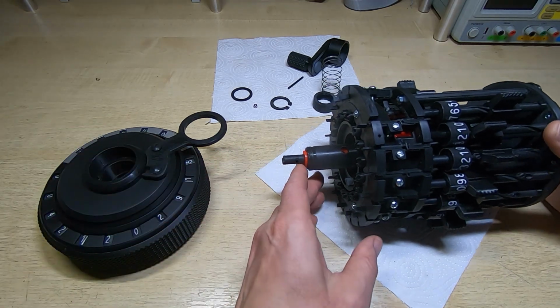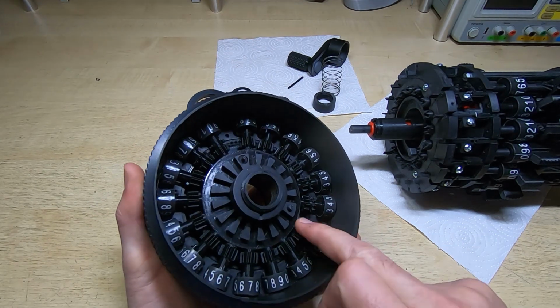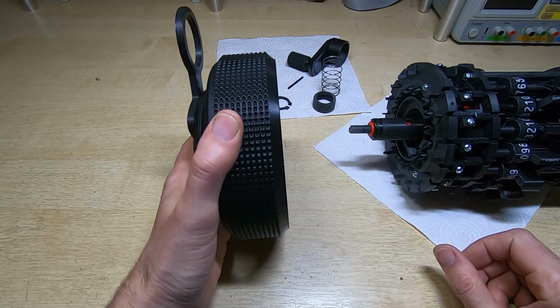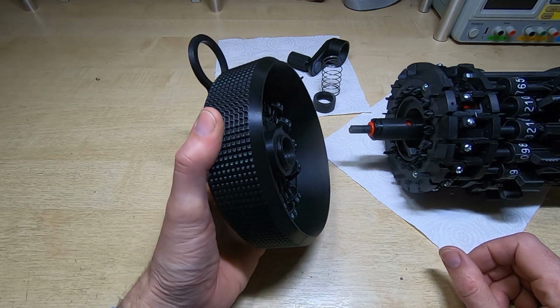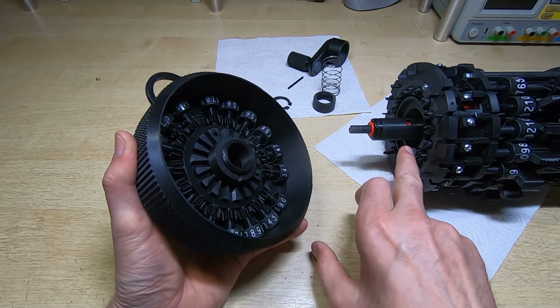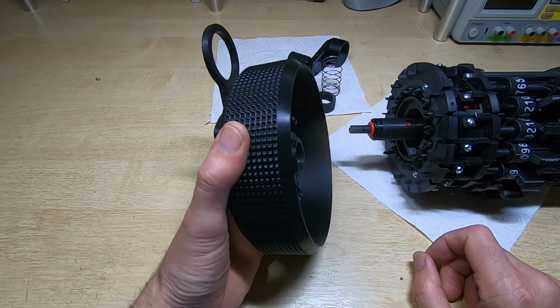There are some other ingenious lockouts as well. So one of them is the stop pin. When we raise the calculator, we can change the column that is being worked on, and this pin hits this post, and there's another one around here to limit the rotation of the carriage.